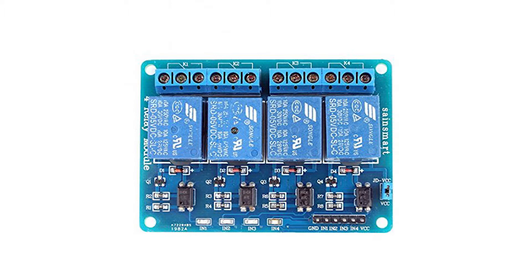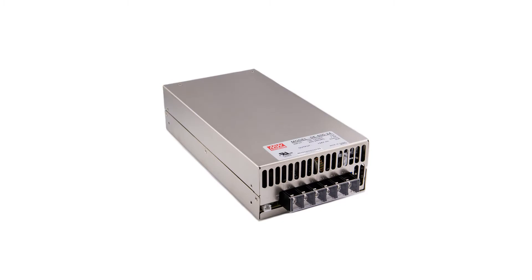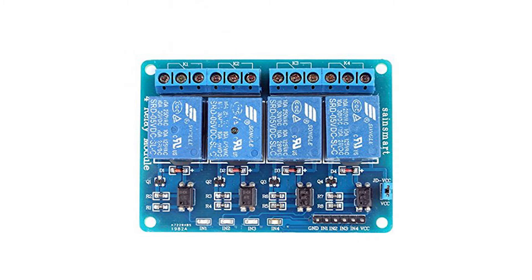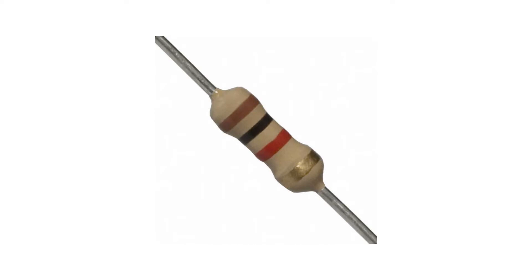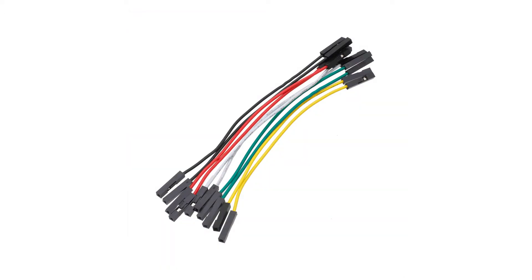First of all, I will talk about all the parts that you will need. Obviously you need a 3D printer with a power supply and a Raspberry Pi with OctoPrint installed. Other than that, you will need a relay board, a 1k ohm resistor, a buck step-down converter like an LM2596 — this is an optional thing but it helps with detection of your power supply when it is on or off, so I recommend you get it since it's only a couple of dollars. You will also need some jumper female-to-female cables.